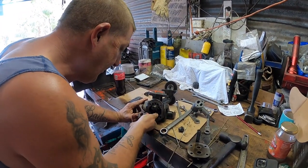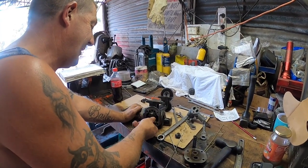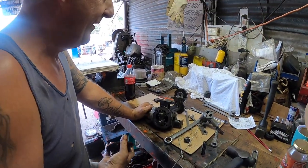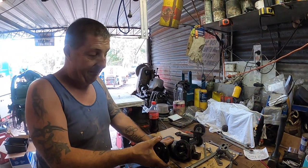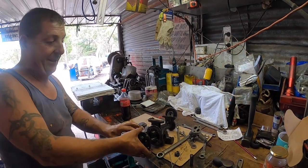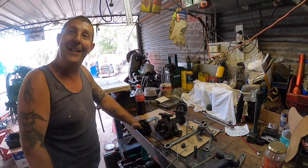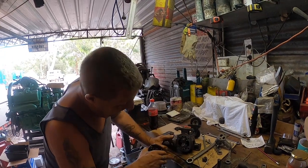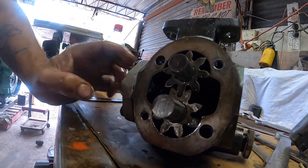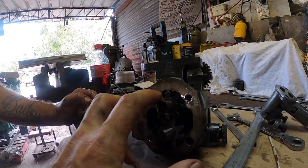Yeah, cool. But I'd say this has been a pump out of a bigger engine at some stage. Okay, they've hacked this off. Oh, right. So a V12 or a V6, another inline or a 671 has another set of gears. Ah, right, and a double set. It actually stacks up, per se. And so that's been chopped down and had an end cap put on. You can actually see the saw marks if you really get up close, compared to that one, which is machined edge. They usually are machined when they're right. Yeah, and it's completely square edge. That's got a slight chamfer on it, hasn't it?